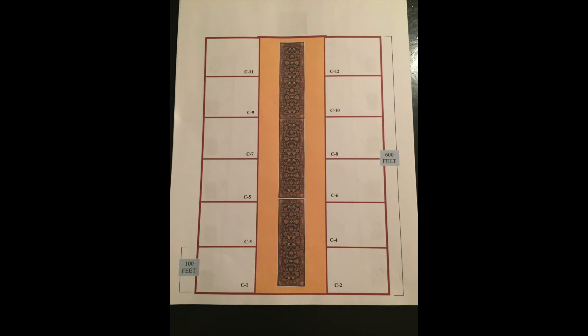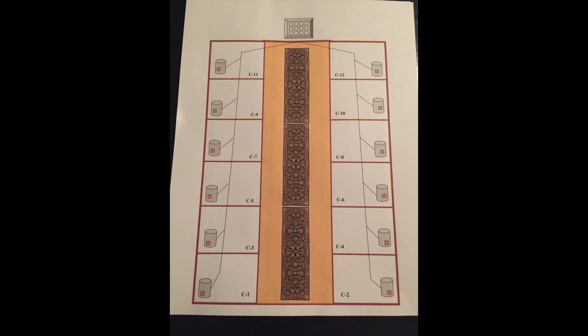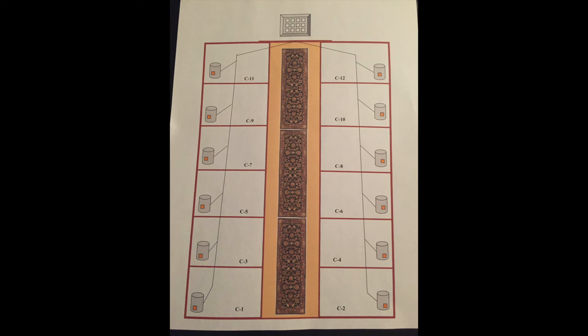Let's suppose we are looking at a bird's eye view of a 600 foot long conference center with a large hallway and 12 conference rooms. The contractor calls for 20 inch balancing dampers in each conference room. EBDL cable can run from each damper to a 12 port balancing station, providing the technician with one central location to quickly balance all the dampers with the wire exclusive positioner with blade indicator. If the building owner decides to make the hallway smaller to make every room bigger, the technician can simply walk right back down that hallway to the balancing station and balance all the dampers again.